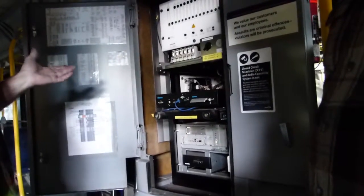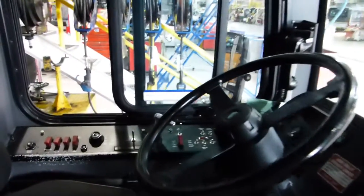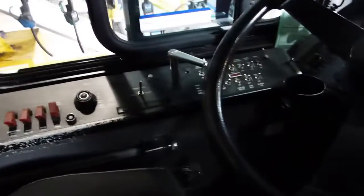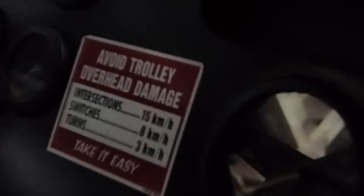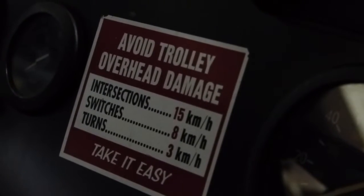We didn't have much breakage, but the other issue is with connections too — when the buses get older and people walk around the roof and touch things a lot, you could have the fiber optic cable shift a little bit and it makes a huge difference in intensity. The slightest movement and I see drops from 120 down to 60. It still works at 40, but in cold weather when you add some melt, it gets even worse — it's a compound effect. So we automatically have a recheck level: if you see something at only 40, it's time to replace.